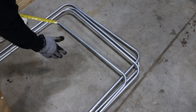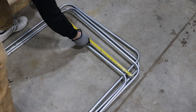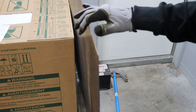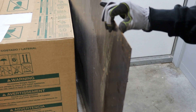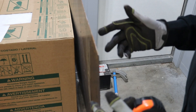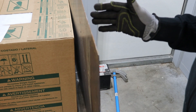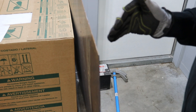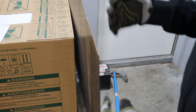So now I'm going to build the platform. I'm going to build it 18 inches wide and 30 and three-quarters inches long, just using 16-gauge steel. I know it bends pretty easily, so I'm going to do something to make it a little bit more rigid. I'm actually going to cut it larger than the dimensions and then bend it one inch in along the edges to kind of make like a little box. Flip it over, and then that's what the rails will get welded to.